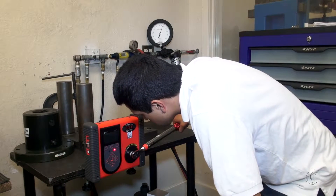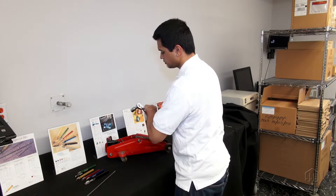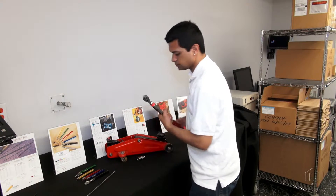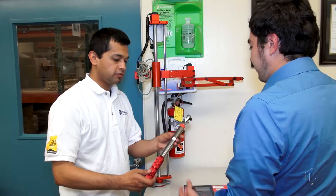It must be preset using a torque analyzer. Preset torque wrenches are typically used in production where only one torque setting is required. If the torque specification changes, the IPT is still flexible enough that a new torque setting can be made using a torque analyzer.